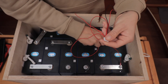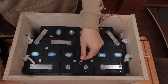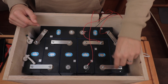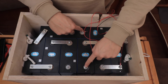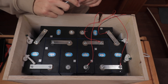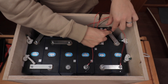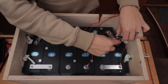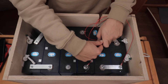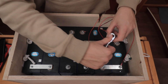Finally, grab your last wire and connect it to your main cell positive. Now you can tighten all the nuts down. The only ones to keep free are the main positive and negative posts, because you'll need to attach other things to them. Be super careful when tightening that you don't short out the batteries — hold the wrench carefully, or wrap it in tape if it's too long. It doesn't need to be super tight; these aren't going to have a big load on them. These cells don't have the strongest posts, so you don't want to over-tighten and strip them out.